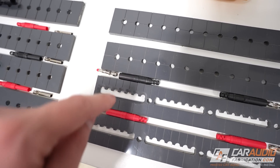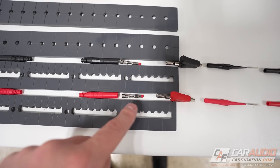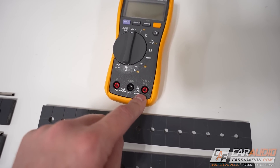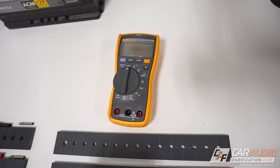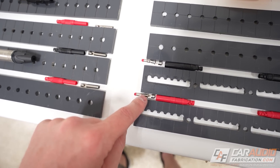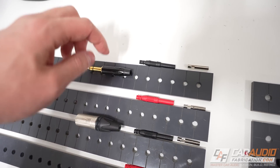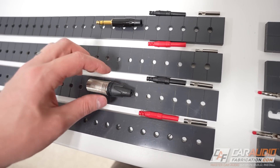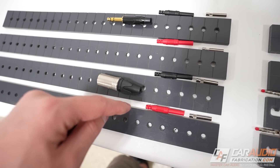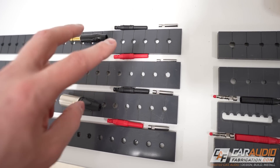The reason I'm going male on this end is that once we have these probes assembled, let's say I wanted to use the alligator clip — I would just connect that connection there. And if I wanted to use this with something like a multimeter, that's a female connection, so I'll have a probe I can just plug in. On the pieces I'm using specifically for the MAX, I'm going to turn these into female connections. For the XLR connector, we're also going to add an additional ground connection — an alligator style clip — and I'll mark it with some green tape or green marker to note that it's a ground wire.